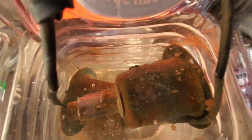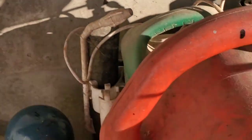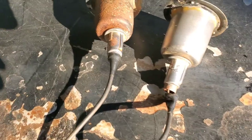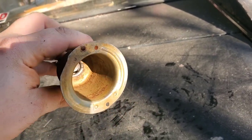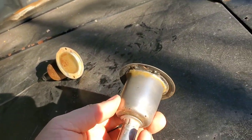It is the next morning and you can see this stuff is just flaking off. This is straight Heinz multi-purpose vinegar, the six percent acidity. I did not dilute it with water, and I did not add salt or anything to increase the acidity — I could have but I didn't. Let me get these out and scrubbed up so you can see what they look like before I paint them. One of these came out very nicely. The other would have required a bit more soaking, but I don't really care about that remaining rust. The inside cleaned up, and that coating you see is just some flash rust.